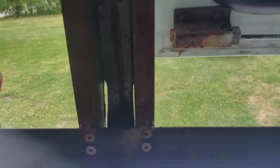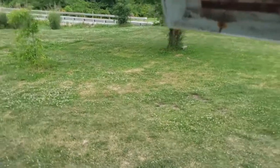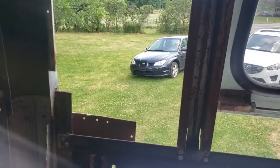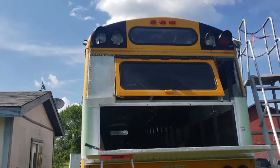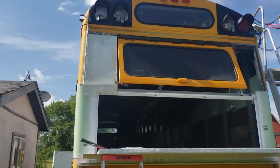So that's what's happening next. Okay, so I've slotted these and bent them in. Now the metal should fit over both sides. So we're going to test fit that, and then we'll look at where we have to trim that and make some marks. Okay, so I've got that first side riveted on 2 sides with 1/4-inch rivets.